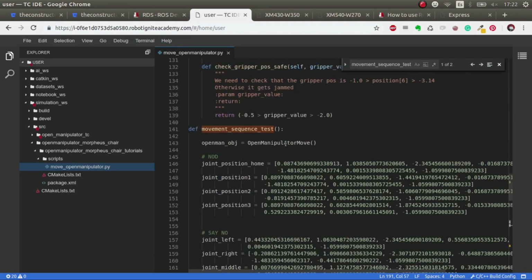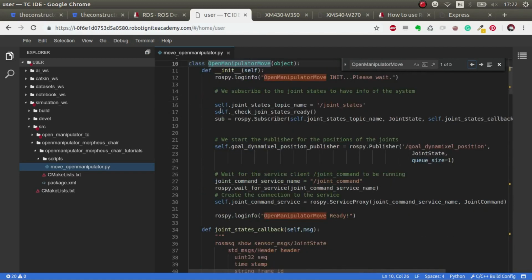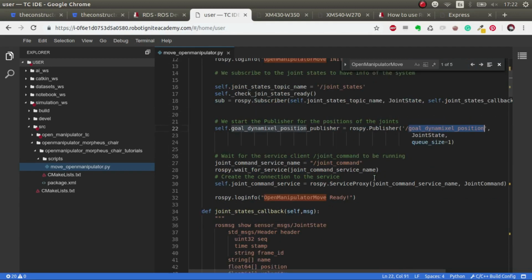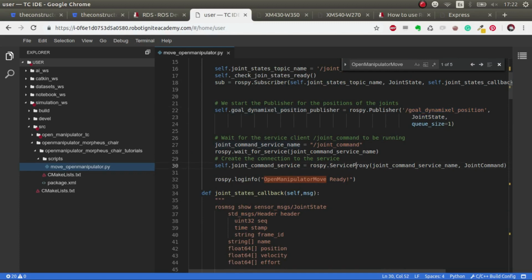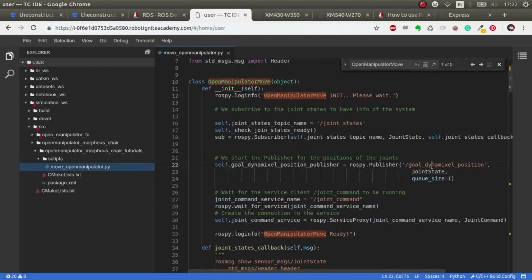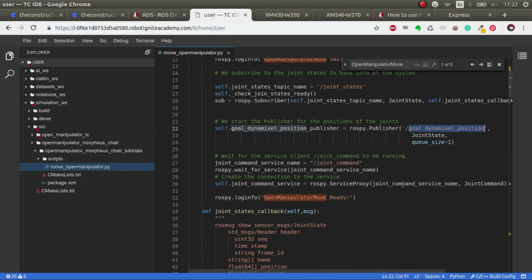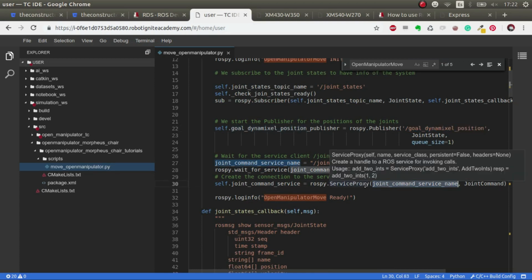So let's have a look at this class, which you can imagine what we've done. In this class, we are initializing a subscriber to joint states. We are initializing a publisher to the goal Dynamixel position. And then we are starting a service proxy to this joint command. That way we can use this system of moving all the joints at the same time, or we can move it one by one securely with the service.